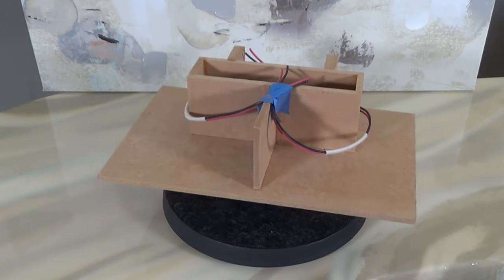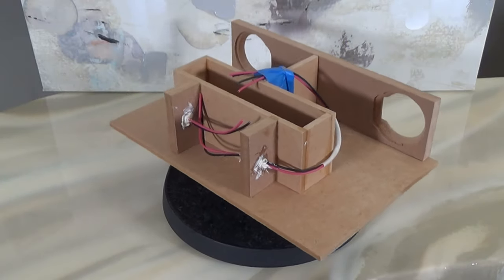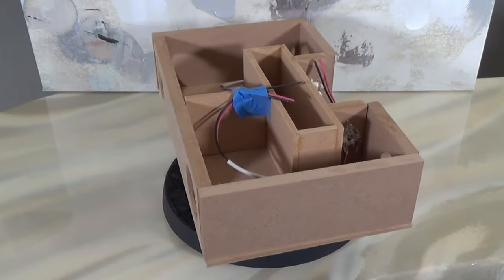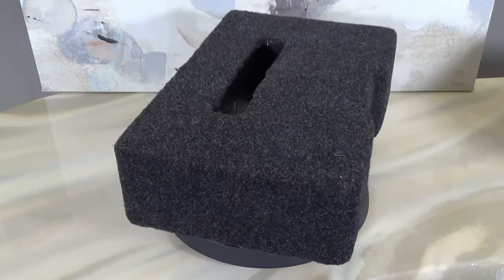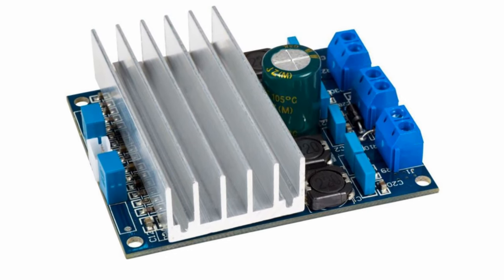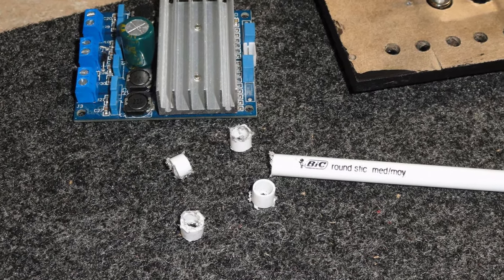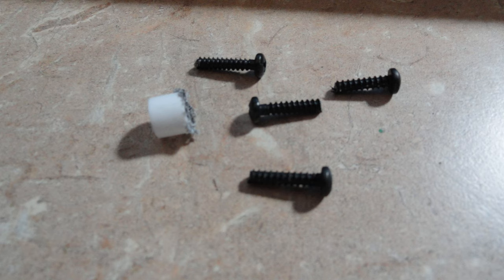How about we take a spin through the construction process to see what we've done so far? Now I think this is a good time to issue this disclaimer: I did measure all the luggage handles in my local Kohl's department store to make sure that my handle opening on this stereo was big enough. But I don't shop at Macy's, so if you brought your luggage from Macy's and it doesn't fit, I'm sorry but you're on your own. Now it's time to hook up and install the amp board. I didn't feel comfortable just screwing the board to the back panel — I wanted it to have a little air circulation. So I cut four quarter-inch long pieces of the plastic cylinder from a Bic pen and used them as standoffs for the amp. I had to shorten the screws a bit so they wouldn't poke through the luggage handle opening too.